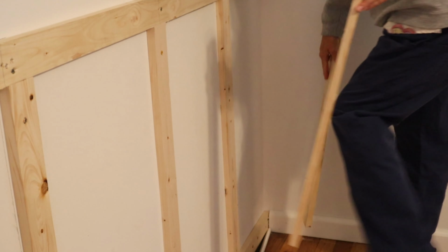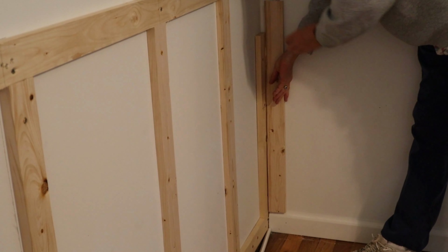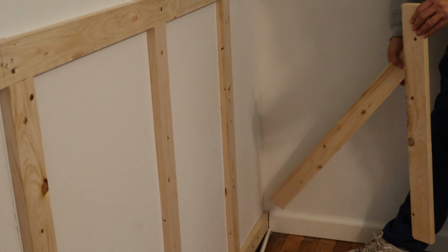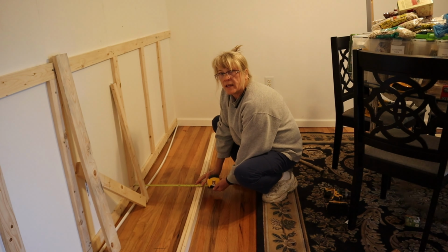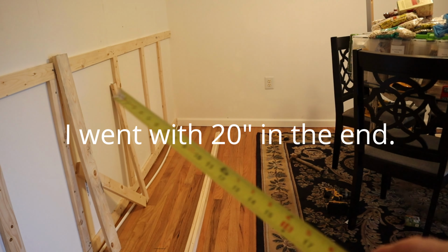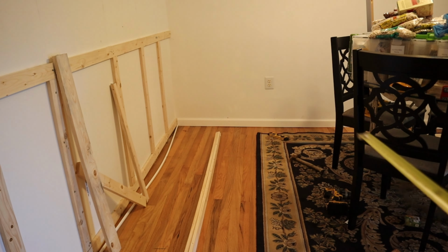I have to finish this corner over here. I got to take this baseboard out. I'm going 18 inches out. I've got to do a support here and a support this way for the corner, and then I've got to build this part of the frame. Let's see, 18 inches. This is 18 inches right here. So I'll come out 18 inches. I'll build the mirror to that after I do the sides. Attach everything, then do the cross bracing and the countertop in episode 3.